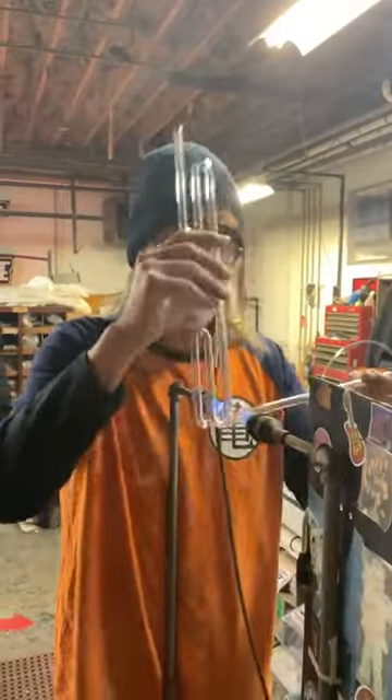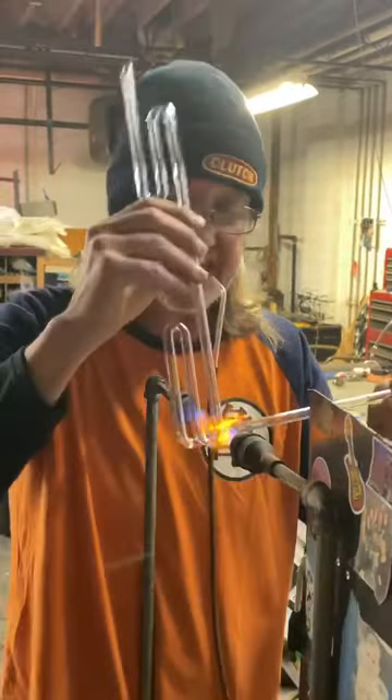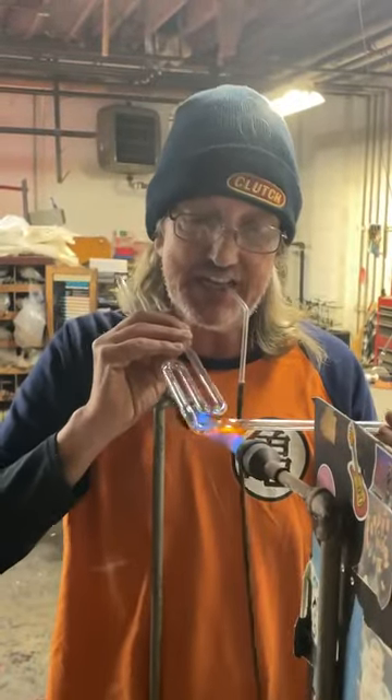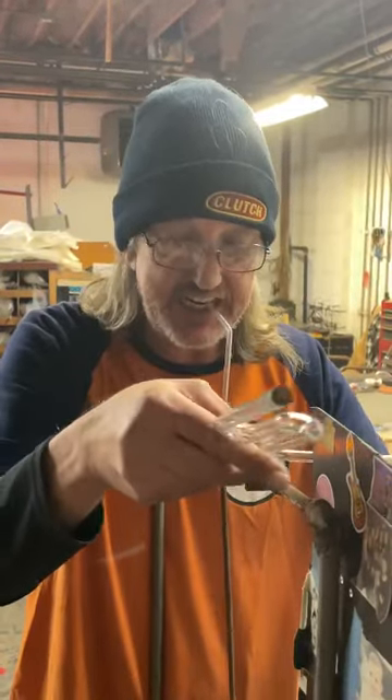Back in the fire with this funky neon. I'm going to do a drop bend and keep it really close to this other stick, because when I lay it on my template to arc it over, it's going to open up to the gap I need.